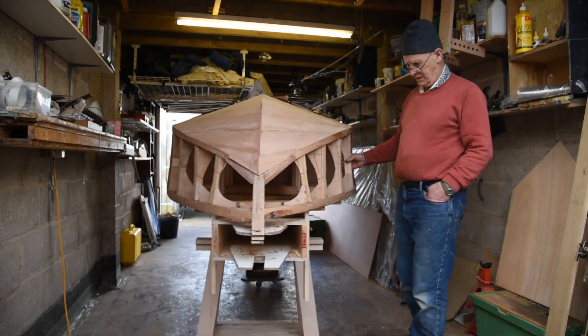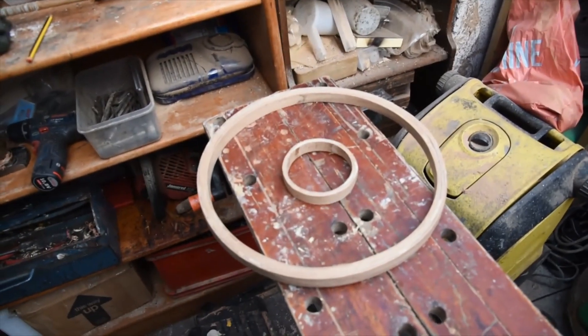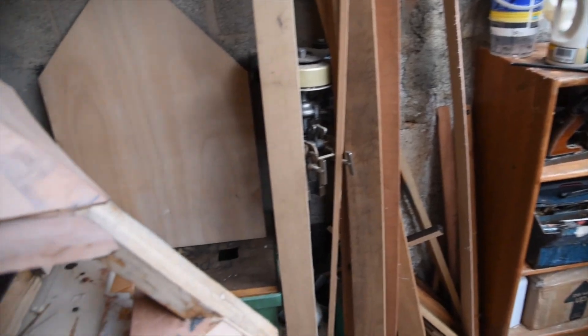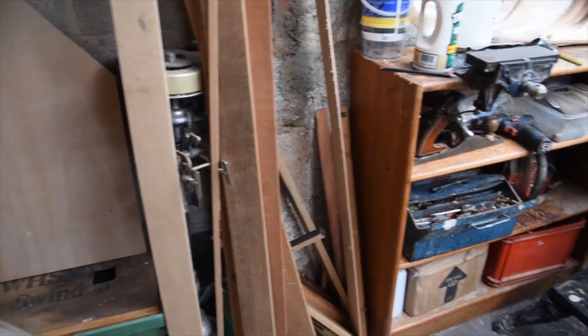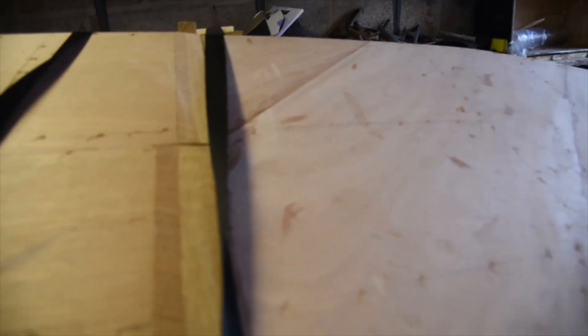So, complete with progress. I'll move the camera in just a minute and show you what I've got here. That is due to become a steering wheel. And here, there's a little ridge which you see where the ply leaps from a flush joint to a butt joint. A certain amount of strengthening and gussets have gone in here to hold the bow together. That is the scarf joint I'm talking about. These are rather tight. Generally, it's coming on.